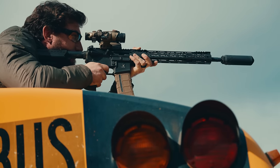We have been shooting this gun both auto and suppressed, which is going to massively increase the amount of heat the rifle has seen compared to semi. As a consequence, as we near 3,000 total rounds, we're starting to get very low on lubrication so we're going to hit it with a little lube. Now here's an old trick — checking if the gas rings are still good. Oh boy. I think those are worn, my dude.